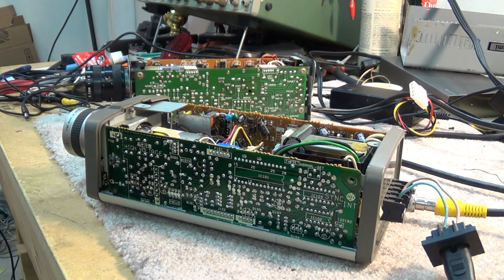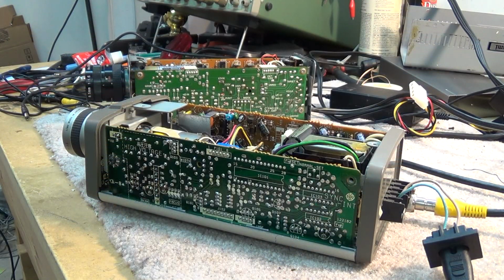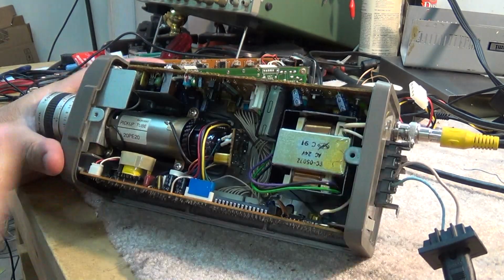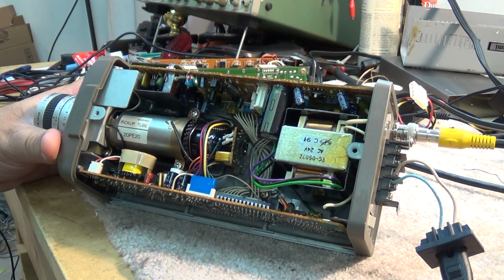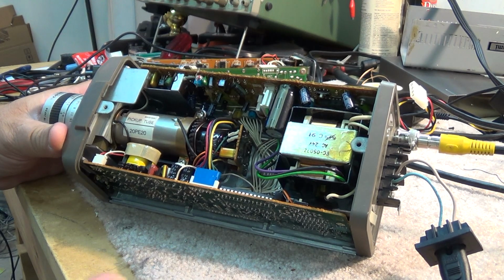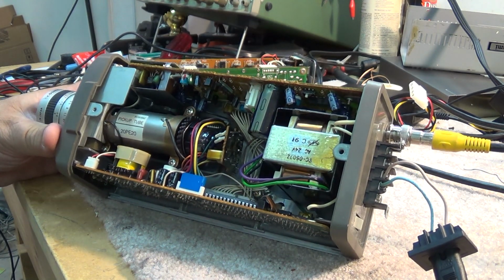That way, if you're putting in a closed circuit system, you didn't have to pull AC to every location where you were going to mount a camera. You could just run some standard alarm wire, standard bell wire as it's called, to each location, and a coaxial line for the return video. And that way they didn't have to pull permits and stuff. If you were putting a closed circuit system in a commercial building, you didn't have to pull electrical permits to have outlets installed. They could just use one transformer and run a bunch of cameras. Still done today on a lot of the cameras now. You go to Costco or any of the places and you buy a DVR with 4 cameras. You'll have one power supply, and it'll feed all 4 cameras over the Ethernet or over the coax or whatever they're using anyway.